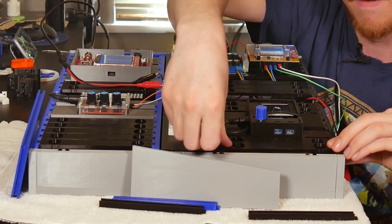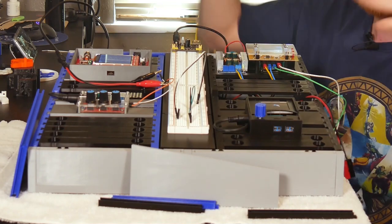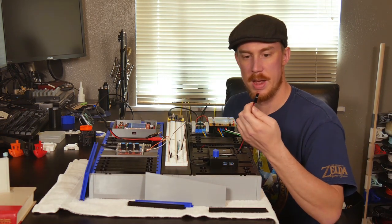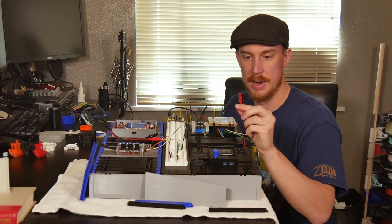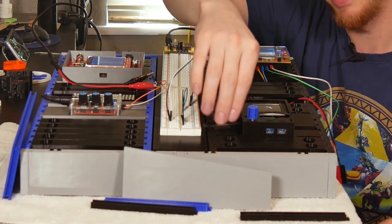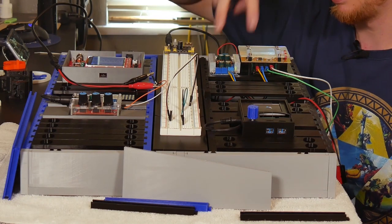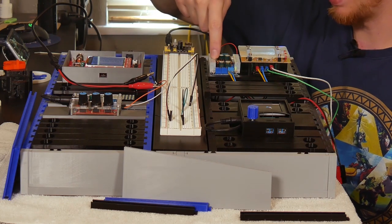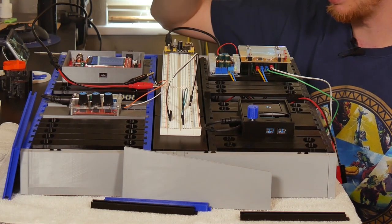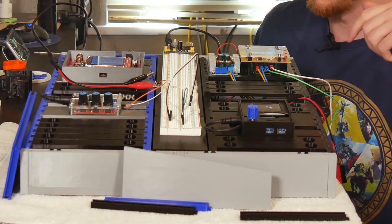And it works fabulously. I've also printed out these bay covers so that you don't just see all the exposed wiring and lever nuts underneath. I've got everything wired up to accept the Anderson power poles going out from the power supply. And then from there, I connect one of these barrel jack connectors, because it seems that all of these bits run with a barrel jack connector with the exception of the variable power supply. Here I've got the buck converter wired with screw terminals, which I will be terminating the wires like a DuPont wire kind of, so that those are a little bit more secure.